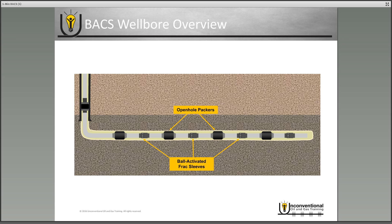A secondary component to consider is your casing packer. It's very flexible in what you can use here — as long as it can withstand the temperatures, pressures, and the weight of the completion below it, you can use whichever type of packer makes sense for you.